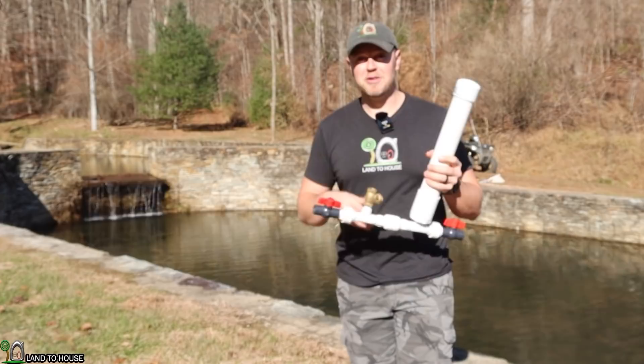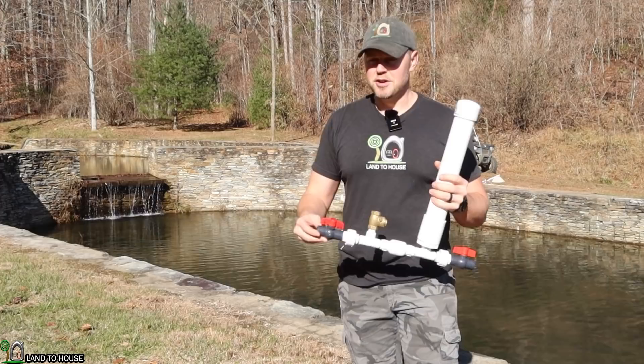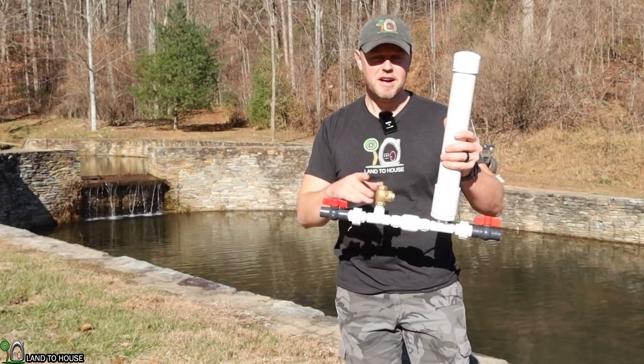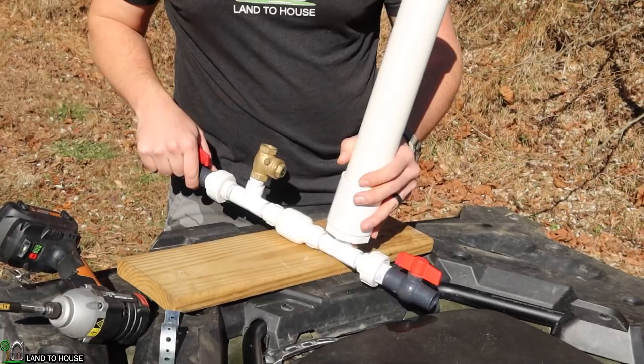Today's video is going to be a little bit special. We're going to be installing this ram pump floating on this pond behind me. It's a very unique install. Quick disclaimer: the ram pump must have the water source coming from above the pump. You can't just set this into the water and hope that it's going to work. So you'll notice I've got a little waterfall back here — that water is going to fall into the pump and activate the waste valve while this thing is floating on top of the lower pond. The water has to come from above the pump.